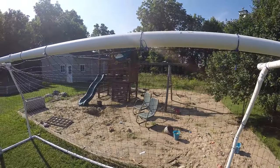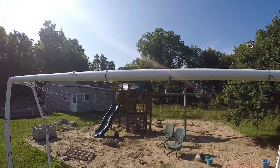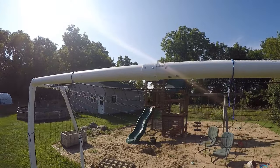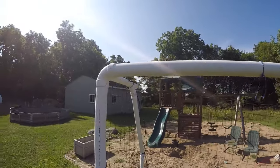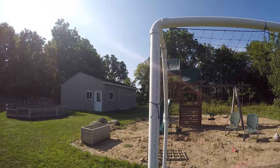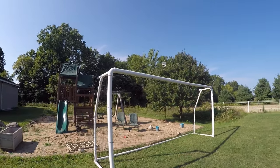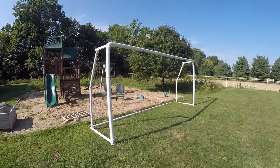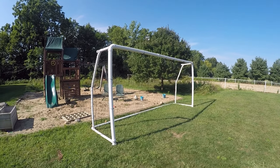Start with a three inch by three inch by two inch PVC DWV 90 degree all hub elbow with side inlet connected to the PVC top rail. Build out the top rail with a three inch coupler. I used the full 10 foot three inch PVC and seated the three inch coupler. The remainder of the top rail is 68 inches, giving an outside dimension of 198 inches or 16 and a half feet — so the inside dimension is about 16 feet.